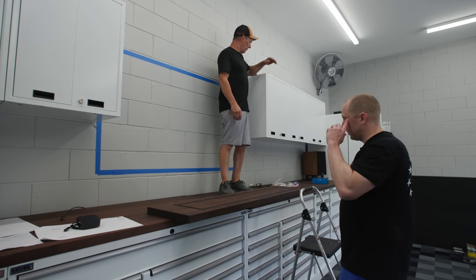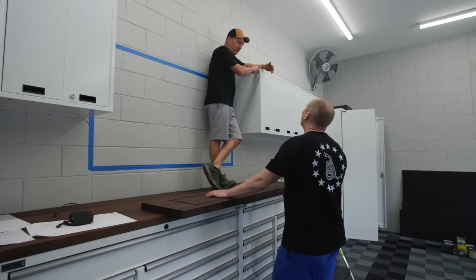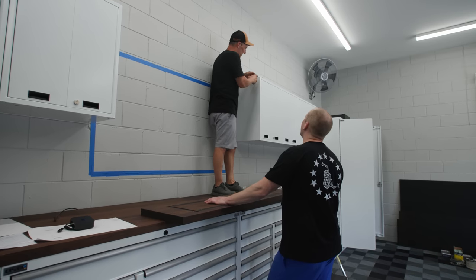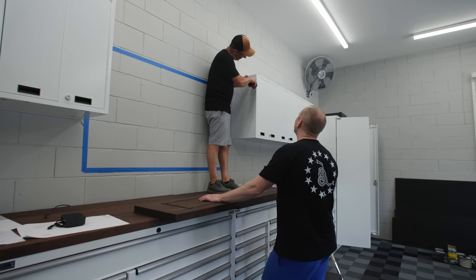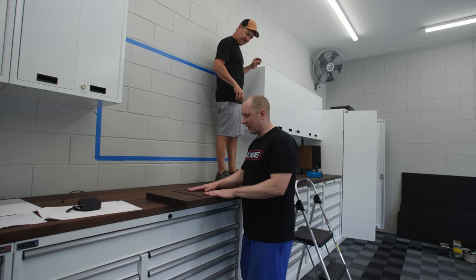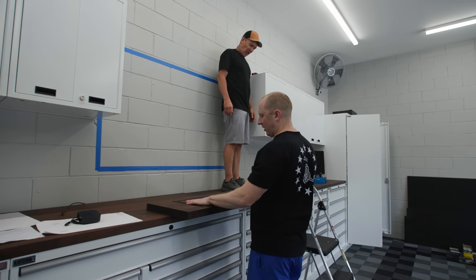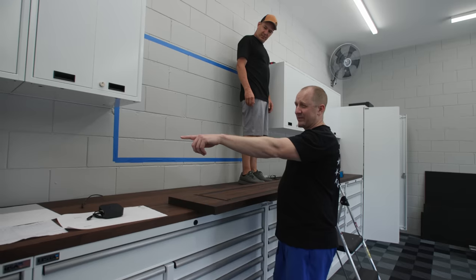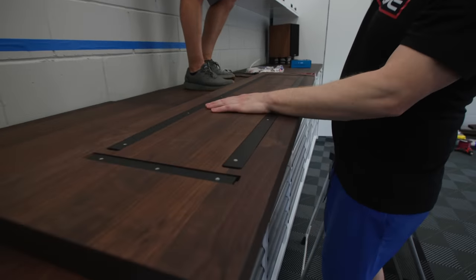Let's figure out the height here - I'm thinking two inches from the top of the shelf. When we designed this, I thought it would look better to have the shelf floating. They put in really stout bracing because the center channel weighs about 60 pounds, and I wanted floating but without any visible brackets.